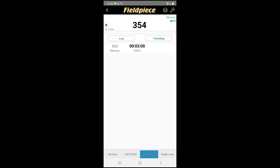I'm just getting back from lunch, and the cool thing is I can pull it up on the JobLink app. The entire time I was eating my lunch out in my van, I was watching the evacuation. Altogether, I was, I'd say, 65, 70 feet away from the AC unit, and I had full connection the entire time. From the looks of it, our evacuation is looking good. So we're going to go over there and do our decay test now.